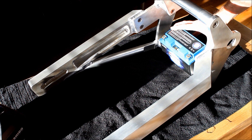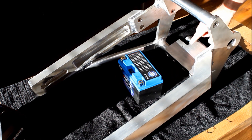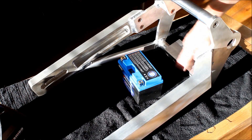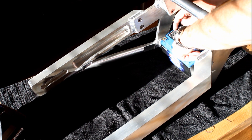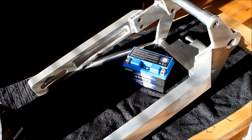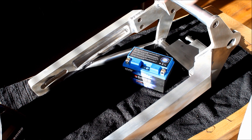So the next step is to make a tray for this — a battery box that will bolt onto here. We've already roughly marked out where the holes have to be; they'll be drilled and threaded. We'll make a billet tray for it to sit in with two uprights and a cross piece to hold it secure. I've also got to make a rear wheel spindle, and I've already got a piece of EN24T steel — T is important because it means it's tempered.